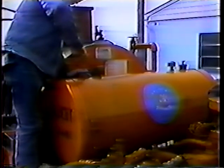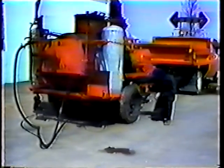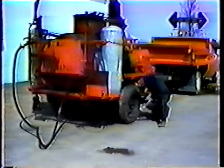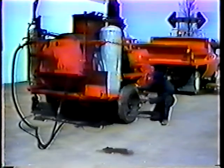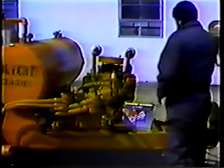After you light the burners, take some time to look over the unit. Check the trailer tires for correct inflation, uneven tread wear, or loose and broken lug nuts. Check the engine oil every day — keep it near the full mark on the dipstick and note the condition of the oil. Extremely dirty or contaminated oil can ruin the engine. Cold weather can really put a strain on the battery; keeping it clean and maintaining the correct battery water level will help ensure easy starting on the coldest mornings.